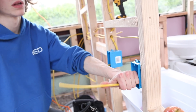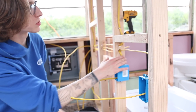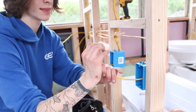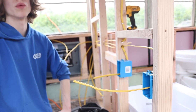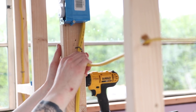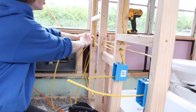Give yourself about six inches of wire outside of the box so when you pull your plug out you have plenty of room to work. Run them all flat and staple them in. When you staple, make sure it's flat and not pinching the wire. You want nice bends — any sharp bends going back are really bad because of something called bending radius. If something's bent too tight, it's not a good path for electricity and it'll overheat at that bend. Get stuff as clean as you can. If you have a 90-degree bend, go easier on the staple so it's not pinching and there's still a bit of wiggle room. When drilling holes in a series, drill them as straight as you can for a nice easy path.